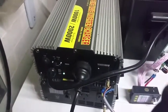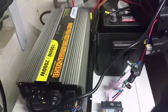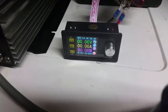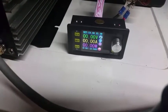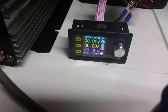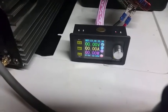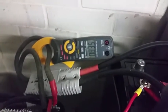What I'd like to know, of course, is how quickly that actually changed over. According to the specs, it's less than 10 milliseconds — so quite fast. That would be suitable to keep a computer going, a desktop computer. Now I'm just monitoring the voltage in the battery, and I can see that it's holding around 12.54–12.55 volts, so that's draining steadily. It dropped about an entire volt as soon as the inverter went over to inverter mode from charger mode. That's consistent with eight amps coming out — eight amps at 12 volts is nearly 100 watts of power going out. So this little freezer is using about 100 watts of power, possibly a bit more, with maybe 5–10% losses through the inverter.